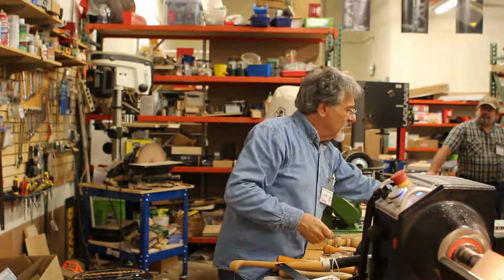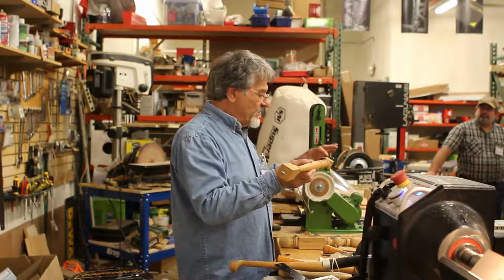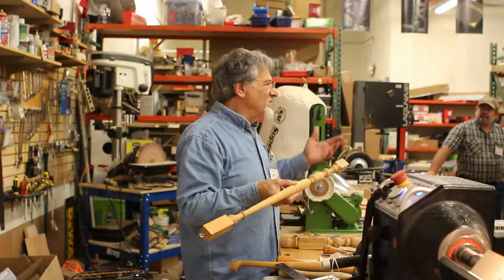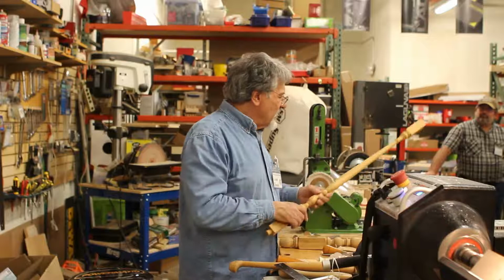I brought some of those things to look at. This is an example of a kind of baluster that is extremely thin, look how thin this is. It's only a half inch diameter at the smallest. You can't do this kind of stuff without a steady rest. I couldn't do the steady rest demo for you today, of course, since I'm running out of time. But I did that demo a few months ago in Canberra. Maybe at the next symposium, I'll do conquering the long and thin.